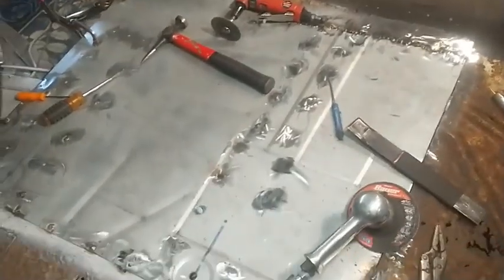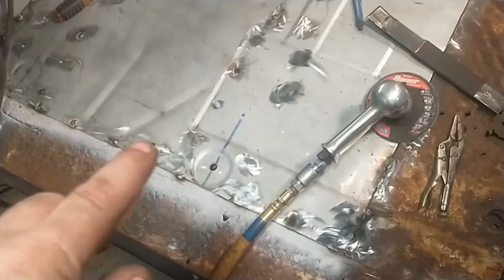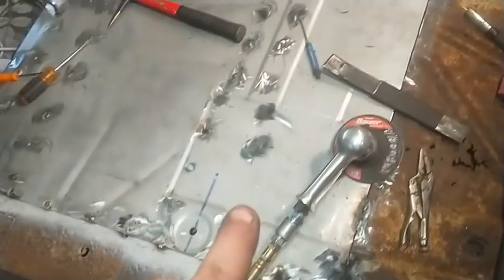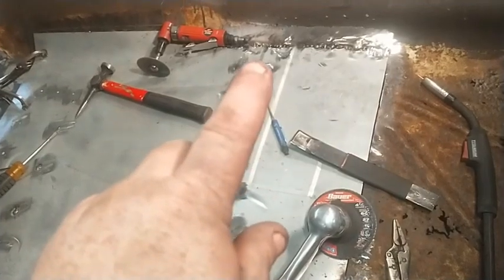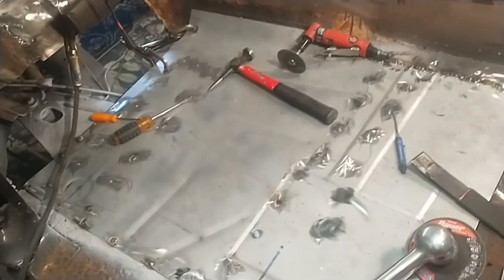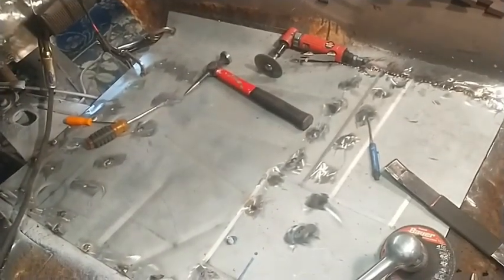Work slow — check, check, and recheck. I started all my welds on this edge to align it, aligned it off of that, and then basically worked down. I attached it here next, then went across this body brace, and then came across this — again working my way toward the front. Just to keep it from oil canning — I think if you went around all the outside edges first it would end up oil canning. And if you don't know what oil canning is, that's where the metal flexes and makes a 'doink doink doink' sound.